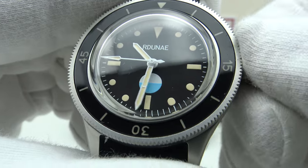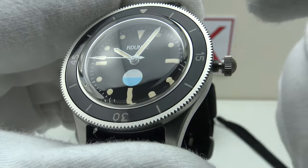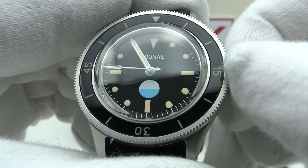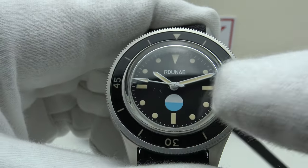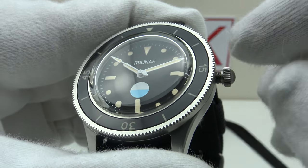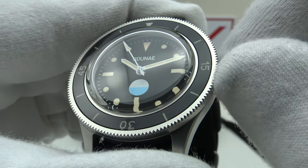Nice firm resistance to the gearing of the 35A, no back play clockwise and anti-clockwise. There's an immediate response when one rotates the crown. Absolute pleasure to set the time, it feels smooth clockwise and anti-clockwise. Pushing it back in, it's got a nice positive click and that restarts the movement. So absolute pleasure to manually wind and also set the time. Just a shame that it has the phantom date setting position.